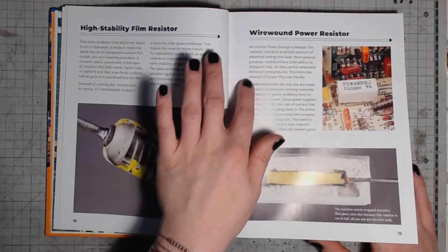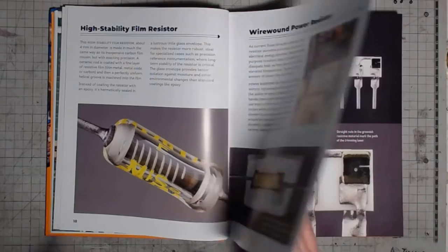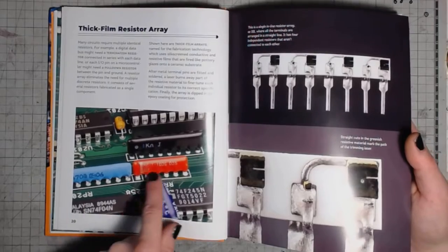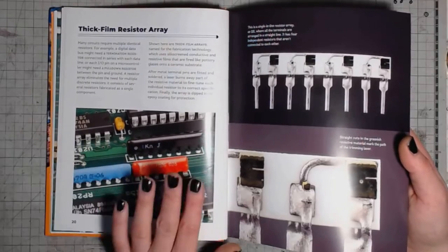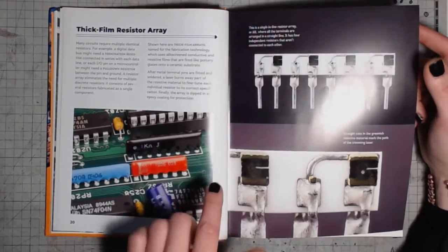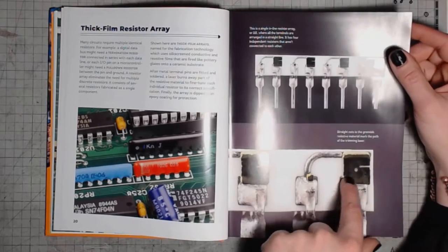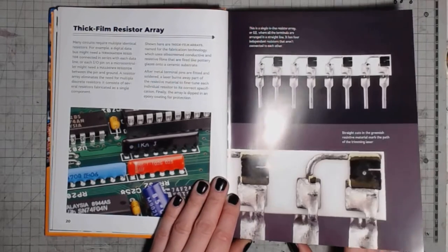There is always some commentary on each one of those parts. Sometimes some interesting or important information is shared. A resistor ladder, it's not really that common in electronic devices, but test equipment uses a lot of those. And here you can see how exactly each one of those individual resistors are trimmed with a laser to have the precise resistance called for in the part's design.